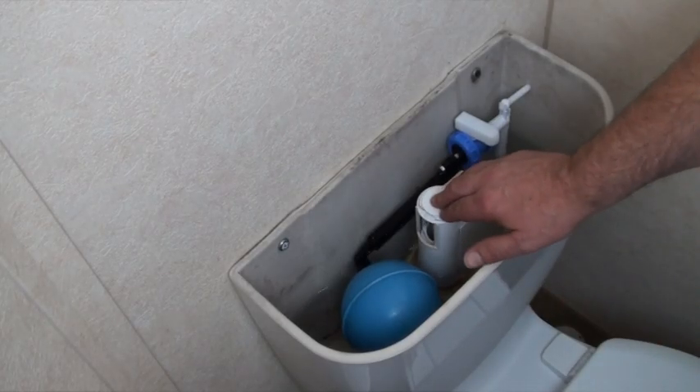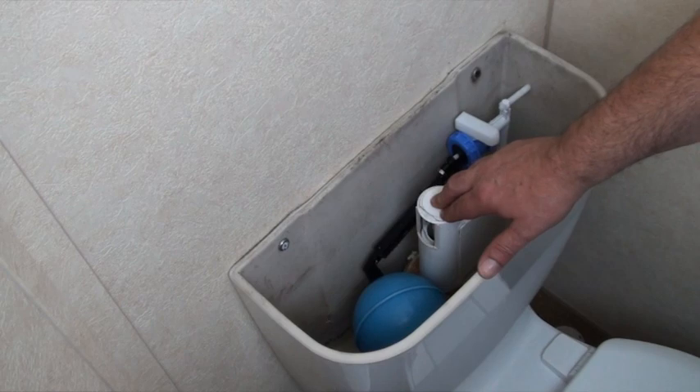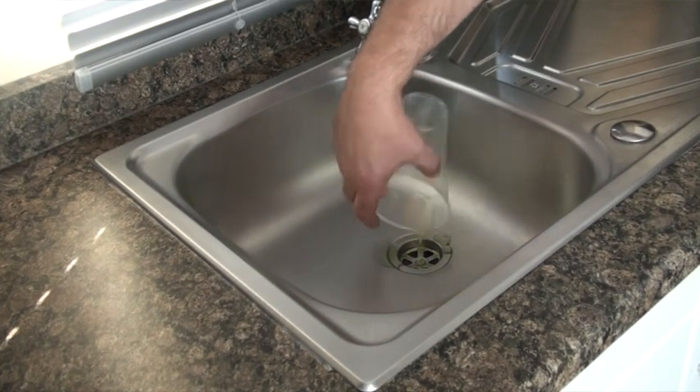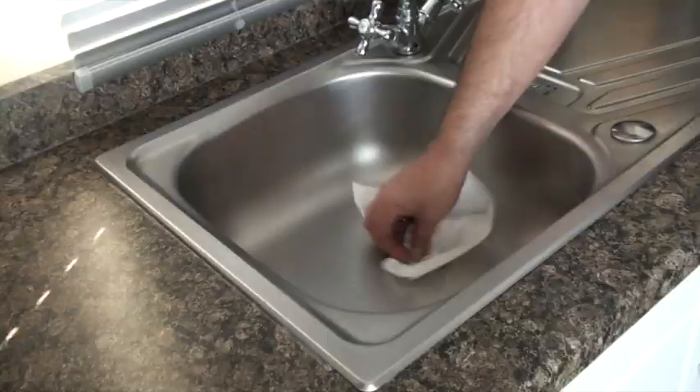Also with the toilets, flush them to allow the ball cock to fall down, which will open the valve back at the elbow. When you're finished, get some normal auto store antifreeze and put half a cup down the toilet bowl, down into the toilet cistern, and also into any other plug holes around the property. It's just a belt and braces approach.